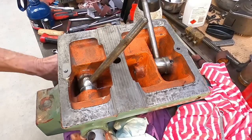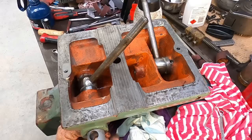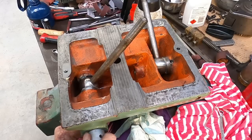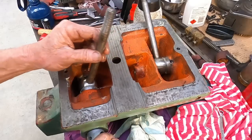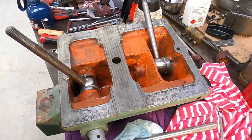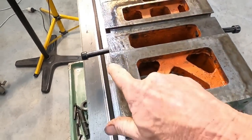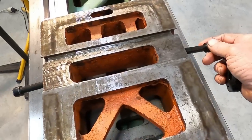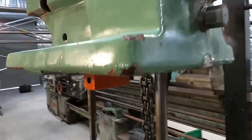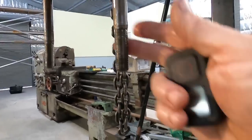So it's just a dog point set screw underneath here — that locates the position. And of course that handle will go in that way. We have our clamping base plate in position, our tailstock base ready, and we've oiled the top of it. We've got our side adjuster screws in location ready, and the top half. We've oiled up underneath and we've got the adjuster nut in position, and all our studs all oiled up.